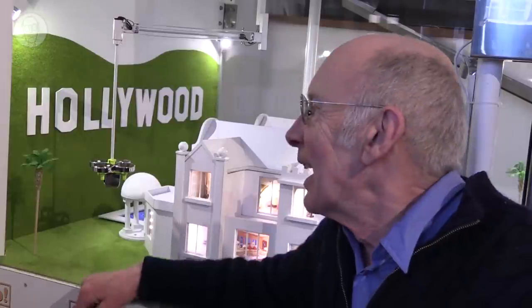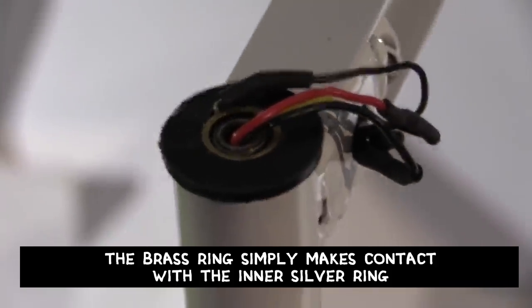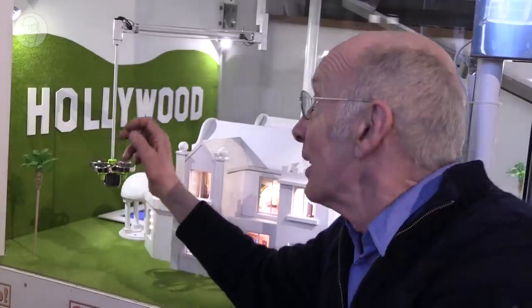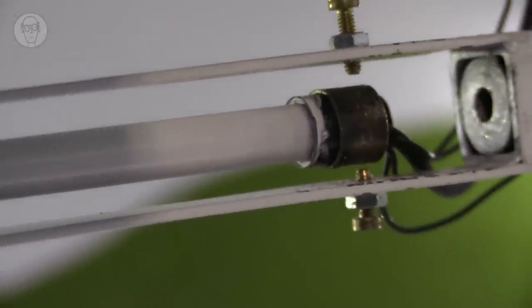Well, I tried all sorts of mounting the drone in different ways, tried all sorts of different tilt sensors and accelerometers and that sort of thing. But I couldn't get anything that really worked as I wanted. So in the end, I went low-tech and made my own little switch up there that detects most of the impact. And then another one at the back there that detects if it gets caught under a ledge. So, I don't know, sensors are never quite as straightforward as they seem. There's always the unexpected.